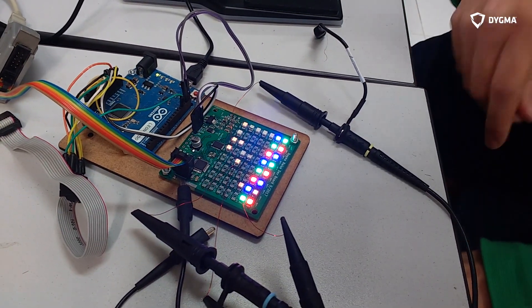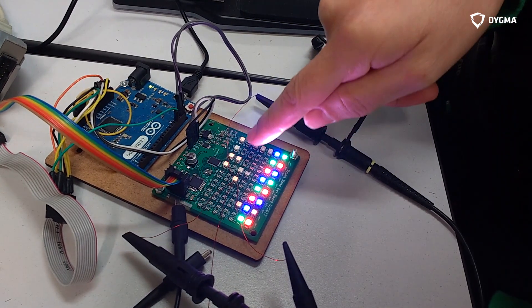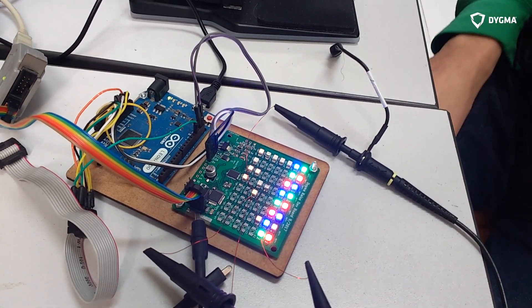One of the problems you can see is that this line is what I'm wanting to turn on, but these ones here showing red are on — and we don't actually want them to be on, they're just on anyway. So why is that happening? Well, one of the reasons is that the forward voltage of each LED is different. The red ones turn on at about 2 volts, but the blue and green turn on at about 3 volts.